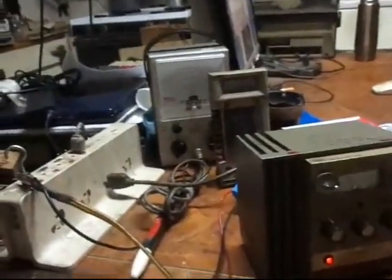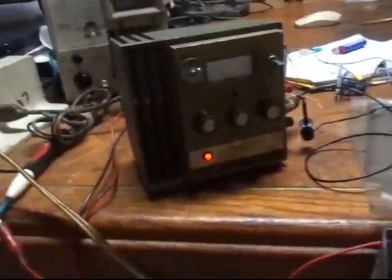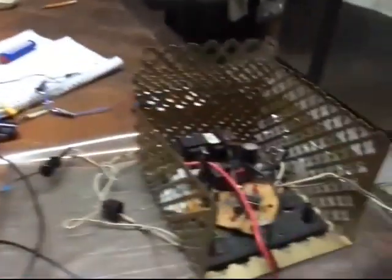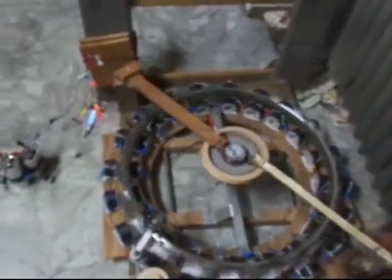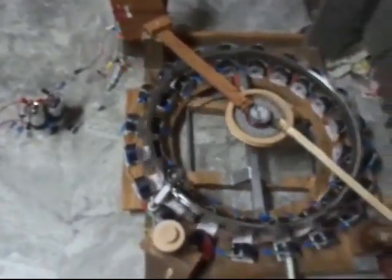One fives, 800 volts. 12 volts there, 12 volts at a half amp going in, 800 at 1.6 mil coming out, into a 100,000 ohm load. And I don't know what the inductance is. Seems like a waste.